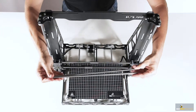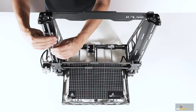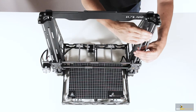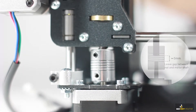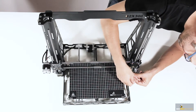Now it's time to apply the threaded rods. Screw them into the flex couplings until they hit the stepper motor shaft at the bottom. With this done, unscrew the very same threaded rod about five millimeters for clearance — you can check the distance using the tape measure. When you are certain the rods are in place, tighten the socket screws already in the flex coupling.